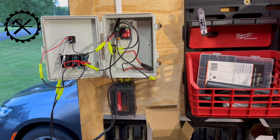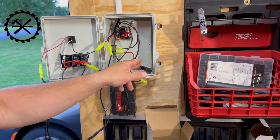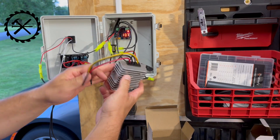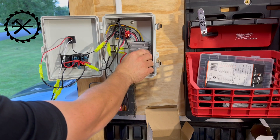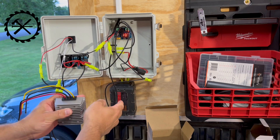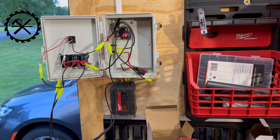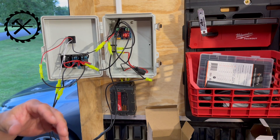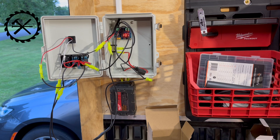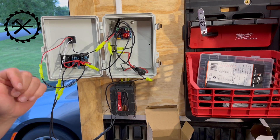So now I'm going to come out of the toggle, go into the disconnect, and when I come out of the disconnect that's when I'm going to put this step-down converter into that circuit. I'm going to install this down in here so it converts it to 12 volts. I want to put this after the disconnect to make sure that I'm protecting the battery and I know it's going to shut off at like 14.1. I did talk to somebody who knows a decent amount about batteries - I actually sent him a 12.0 M18 battery to fix. He knows the voltage per each battery bank inside.